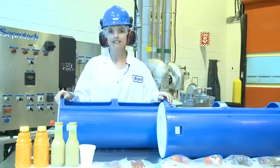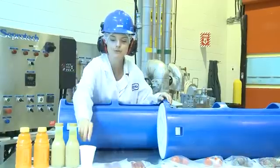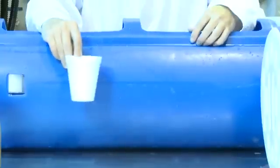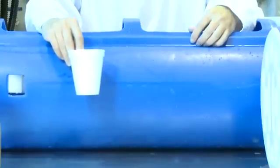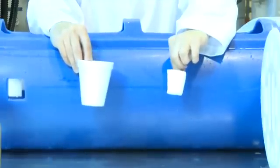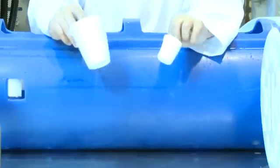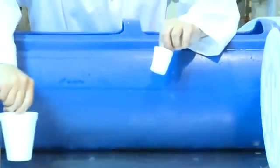To highlight products that may be inappropriate for high pressure processing, I put a sample in a Styrofoam cup. Styrofoam has a lot of fixed air bubbles. With high pressure processing, these air bubbles will be crushed and compressed. Coming out of the high pressure, here's our Styrofoam cup that has had all the air removed. Products like rigid foam with formed air bubbles would not be acceptable for high pressure processing.